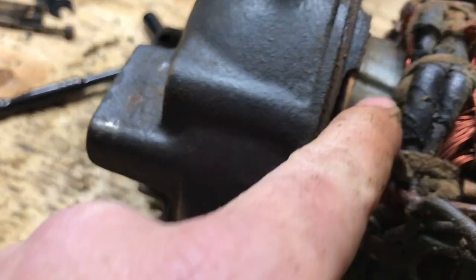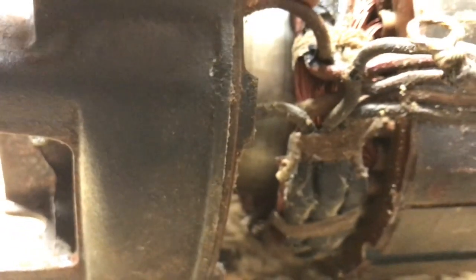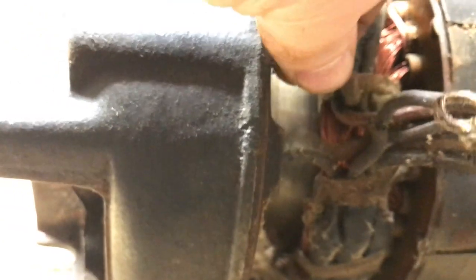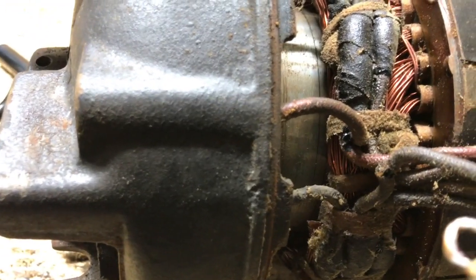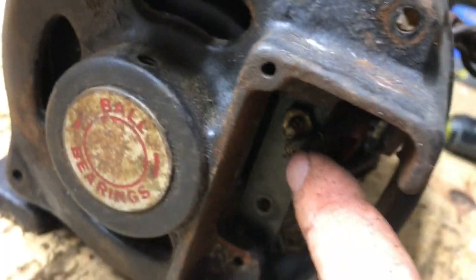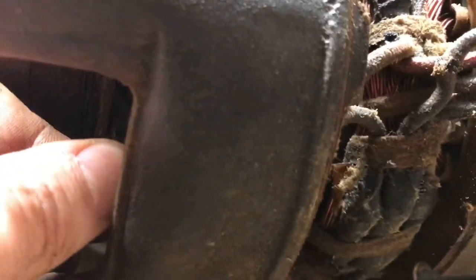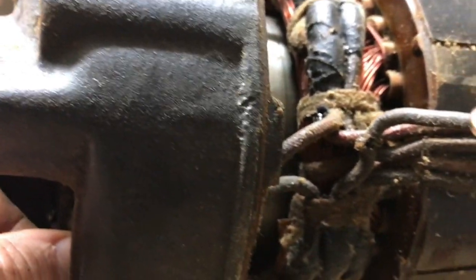Is this one right here? Okay. Get a little light going. There we go. It's this one right here. This one, which is the uppermost wire with the loops. It's the highest wire with the loops that's not going to the capacitor, it's going to the stator. Okay? Right there. Okay, this top stud on the outside with this loop of wire, it goes nut, wire, washer, nut. And this wire is the black wire right here where the 4 feeds come in on the bottom closest to the back. Okay, that one right there closest to the back. That's the top stud outside.